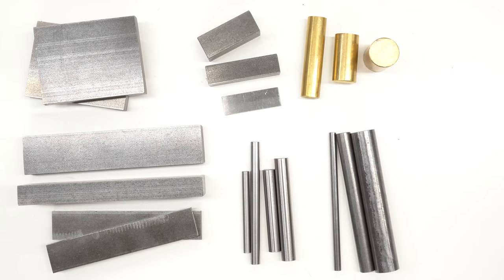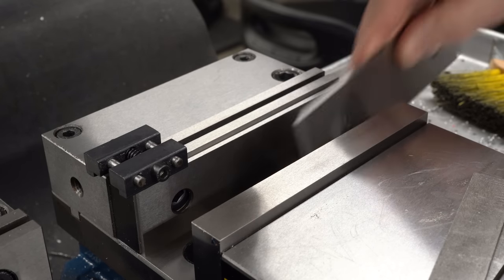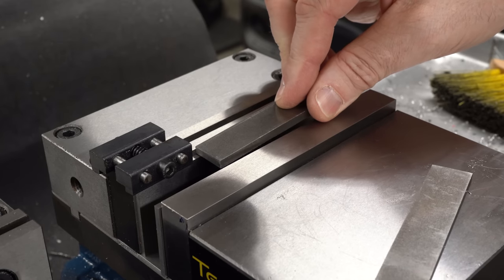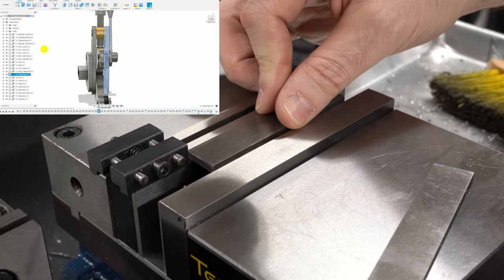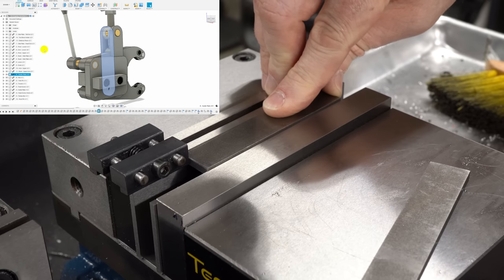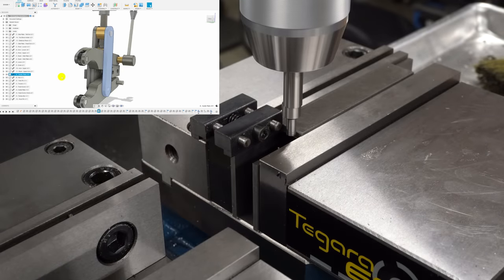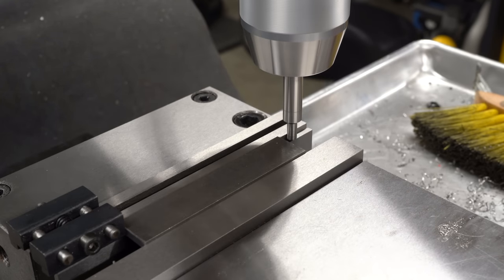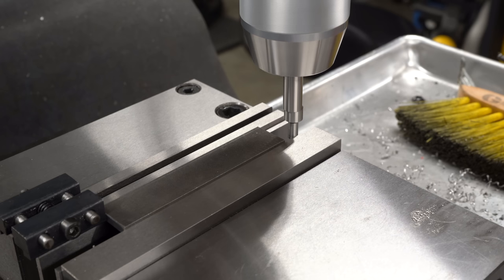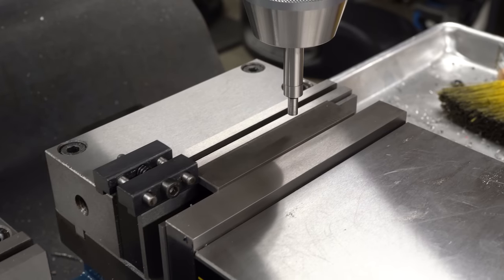Now I just have to pick a place to start, and I'm going to start with the side guide plates for the pressure assembly. For now I'm not going to bother trimming these parts to length - I'll wait until they're done and use the rounding operation on the ends to establish the final length. All we need to do is drill and ream the holes and put the other features in. I'm using the half function on my DRO to find center both side-to-side and front-to-back, then base all feature locations off that center datum.